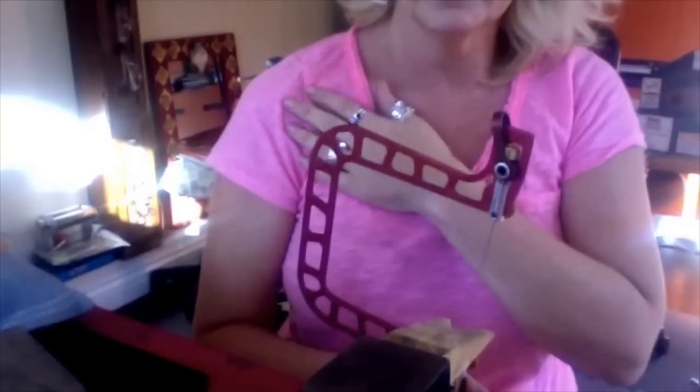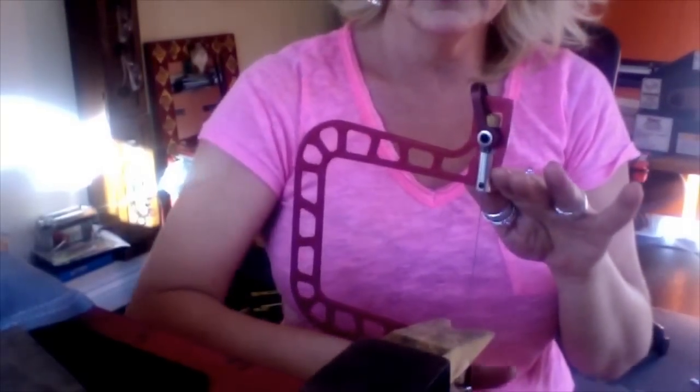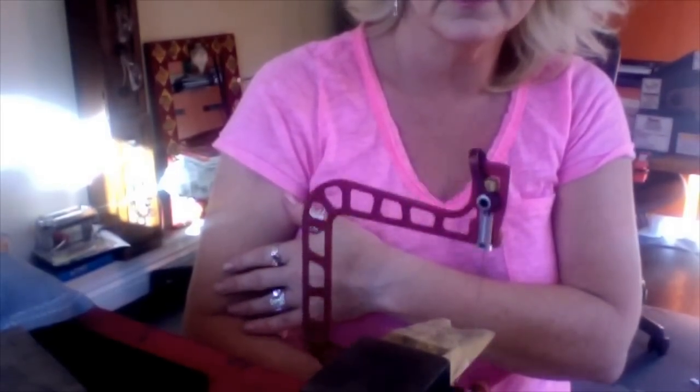When students come to saw, I always tell them the first thing I'd like you to do is just relax your shoulders and loosen your grip and hold it maybe even like this, or just light, so that you're not pulling hard with force. You're just going up and down gently like this. And you're using the whole length of your saw. And you're going up and down, and you're moving from the elbow, not from the wrist. And that's how you should saw.